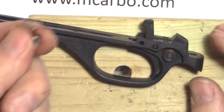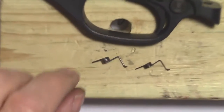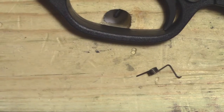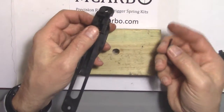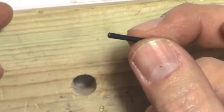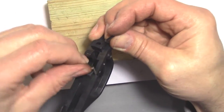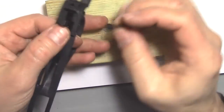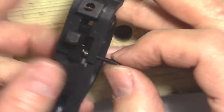There's our stock spring. Here's the kit return spring — it's a finer gauge wire. Put it in place and reinsert the pin. One end is deformed, so turn that away and insert the smooth end in first. Push it through the spring and trigger starting from the red safety button end and going the other direction, and finish it with the nail so it's flush.